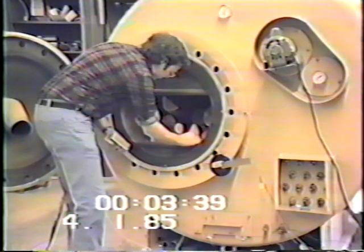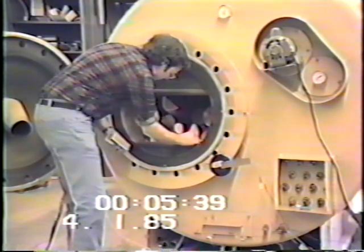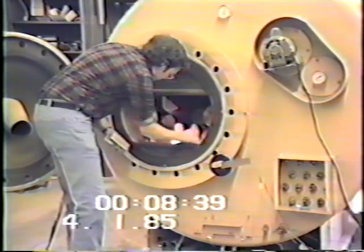The motor that you see in the upper right-hand corner is what creates the induced draft throughout the entire system, creating a strong flow of air from the opening into the combustion chamber — thereby no smoke or materials are coming into the space as you start the fire. This rush of air, with the door open and even better with the door closed, causes the fire to start very easily. You can see one match with a little newspaper is all that's required to get rather large wood to start burning.